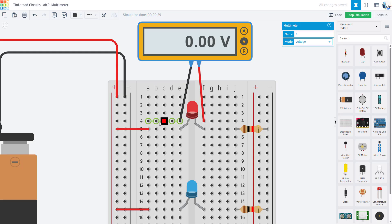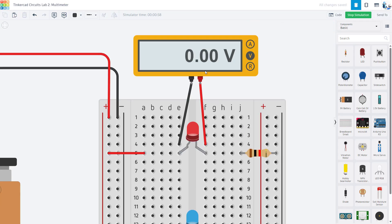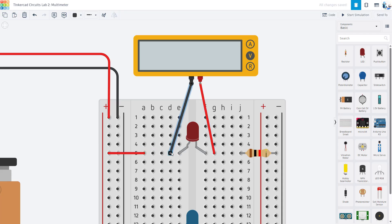To measure a voltage across my LED, I need to move my multimeter leads down to the same row as the LED leads. To move things in Tinkercad, I have to hit stop simulation, then click and move the two multimeter leads down to the same row. The next common question is: why is my voltage negative? My LED is on, so I don't think current is flowing backwards. That goes back to remembering that voltage has a sign convention — it's measured relative to where you have the ground or black lead connected, which is considered zero.